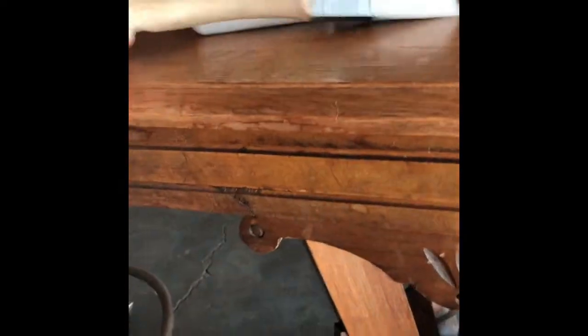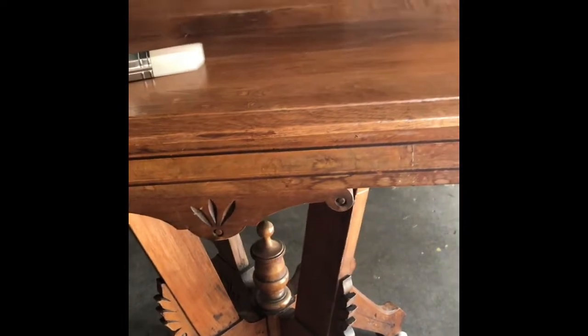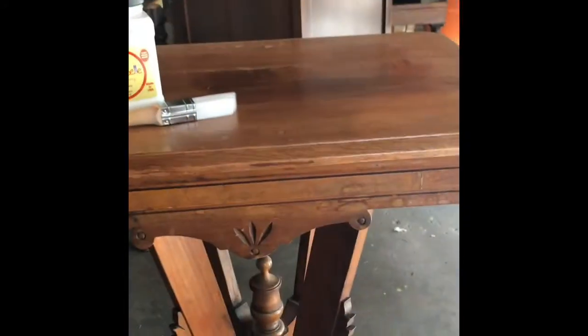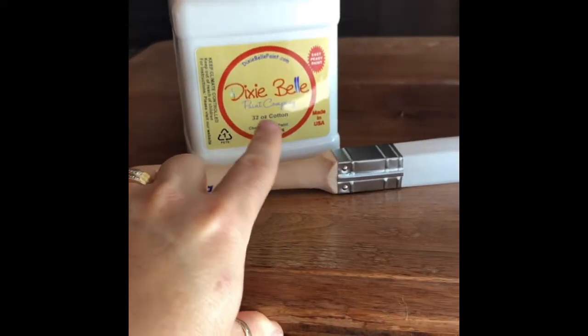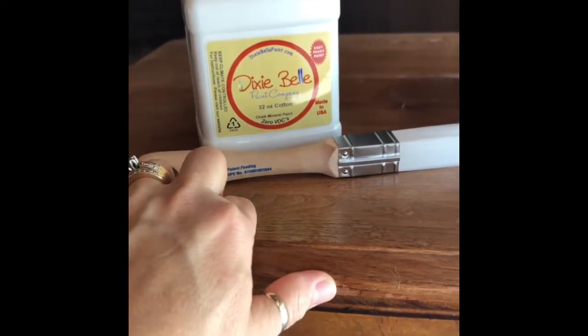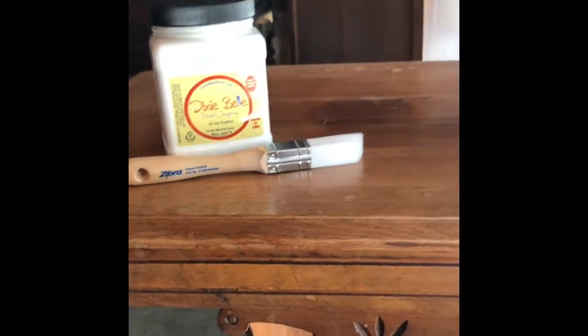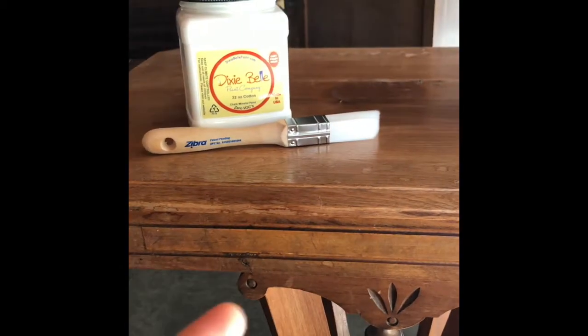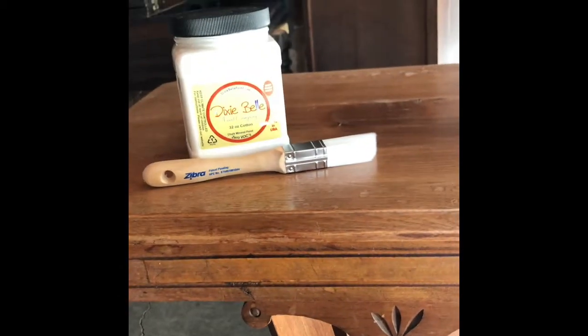Here's one of the questions I get all the time. Are you going to prime? Do you prime every piece you do? Nope, not all the time. Dixie Belle paint makes it so you don't have to. There are certain pieces that I will share and record where I would use Dixie Belle's Boss product. I would put that on before paint, and it would prevent any bleed through, and it also blocks odor.